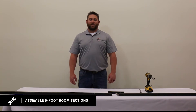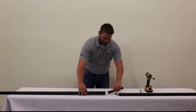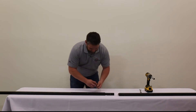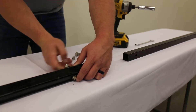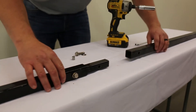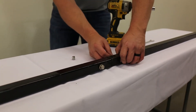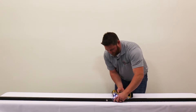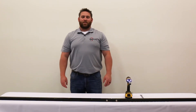Now that we've installed all of our 39-inch extension tubes onto our primary and center section booms, we're ready for our five-foot boom section installation for our wide drop boom. Take our five-foot boom extension with our 8-inch boom connector, slide it until the holes line up, put our bolt through with our washer on the nut side, slide the two together, and tighten them up. Repeat this for all your five-foot boom sections for your primary boom.